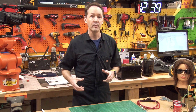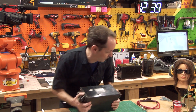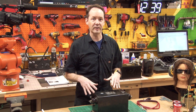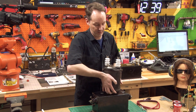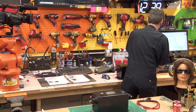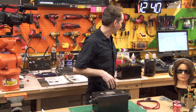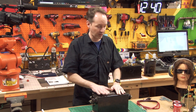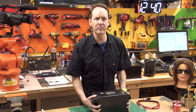This is a really important thing to be able to do because they fail frequently. They're kind of delicate and we need to cover some of the oddities specific to neon sign transformers. Different transformers operate differently, especially when you get into non-current-limited ones. Most transformers aren't current limited, which is why we're starting with neon sign transformers — because they are, which makes them inherently safer and worlds better for the beginner.